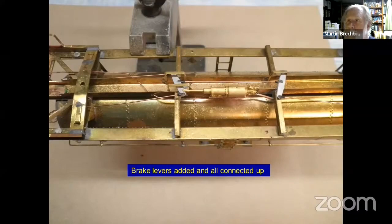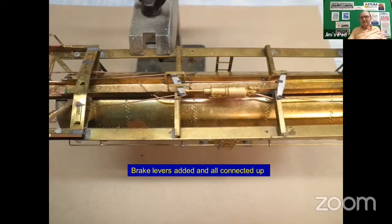You can watch it move. You can watch it settle down smoothly into place. It's hot enough to melt the solder. It's hot enough to join. Now you're done. You don't need that torch anymore. Get it away from everything as fast as possible. Because if you let it sit there about another 2 seconds, maybe three, that piece of brass angle that's soldered to the center sill is going to fall off. So you want it just hot enough. It all sweats together. You're done. That's it. Thank you so much. I just didn't know whether everybody understood what sweat soldering was all about.